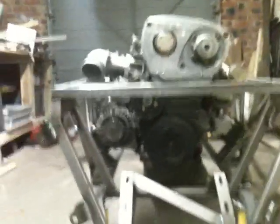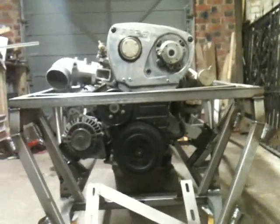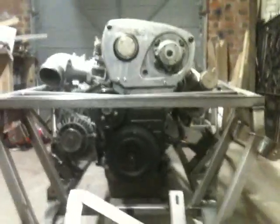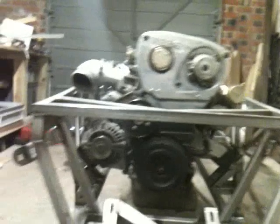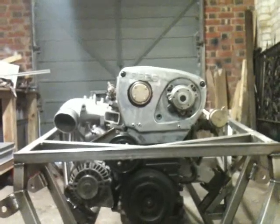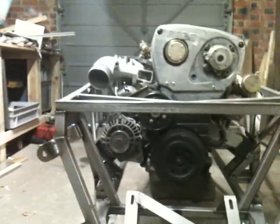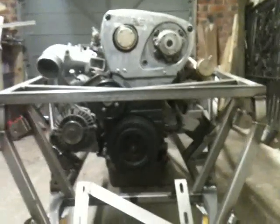Engine height, happy with. Front is a bit higher than I would have liked, but that's not too bad. It's 30mm higher than a standard low-cost Haynes Roadster. Not a big deal because I can always put an engine bump scoop type thing on the bonnet. Not too worried as it's not a huge amount. The bonnet will still dip down about 30mm overall. So not a big deal.